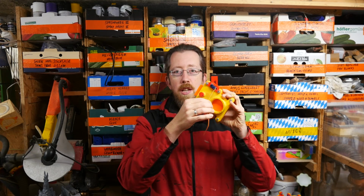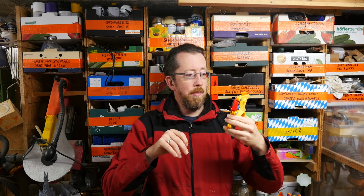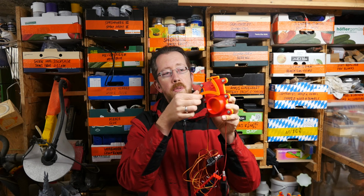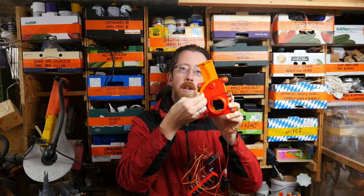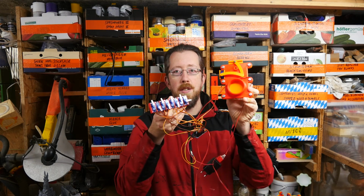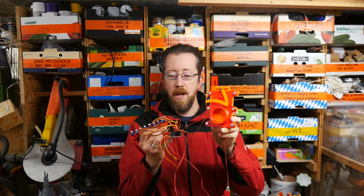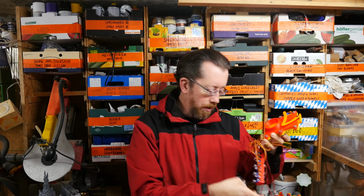As you can see here, the idea was to automate the whole system, which is a whole new kind of worms to open, and I tried to open it. I printed this little add-on to put a servo motor here. And here I have one outfitted with a servo, and it can open and close the blast gate. It works pretty well. Well enough that I went further and took a whole row of them and a dedicated board to control servos. And that worked. Kinda. Well, yes, it worked.